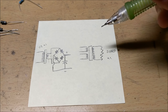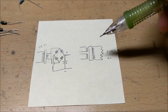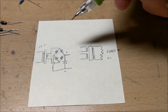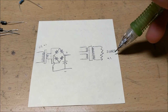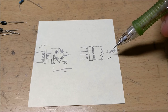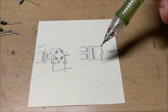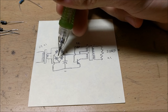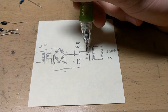Before you actually start working on building your arc lighter, you'll need to design a circuit to actually make it work as intended. What we want this arc lighter to do is take the 110 volts AC from the wall and convert it into 30,000 volts — a high voltage arc that can light things on fire. So how this circuit works is the DC comes from this rectifier and capacitor and flows into these coils.